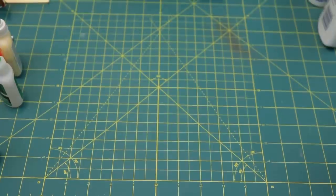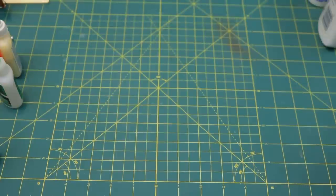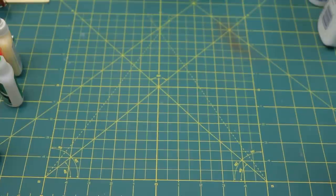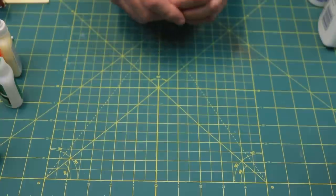And also with that, we want to ask, is our project dimensionally stable? There, we're probably thinking a lot more along the lines of bench work, where we're thinking about wood, because wood over time, with fluctuations in temperature and humidity, is going to expand and contract. So we're going to want to have a glue that has some flexibility there that will allow it to do that.